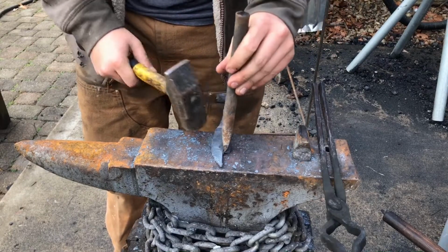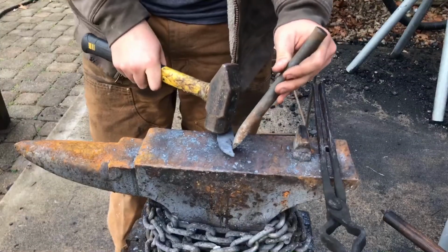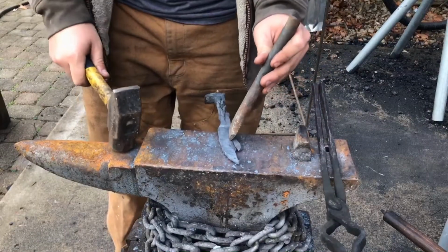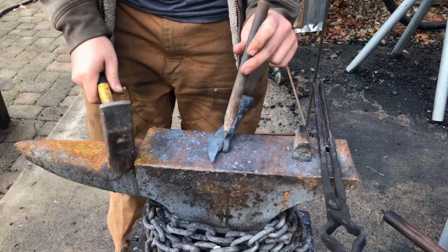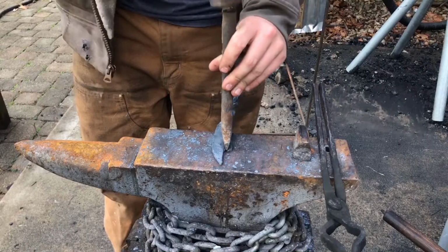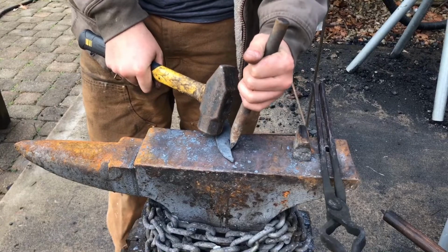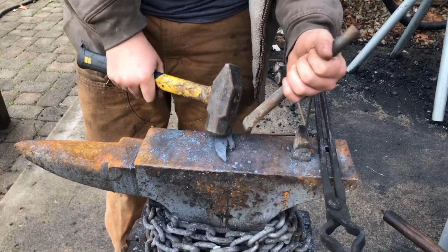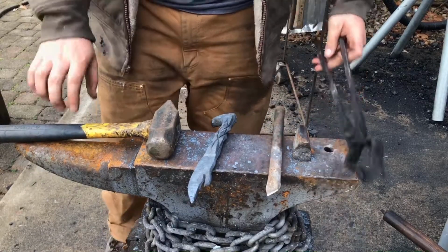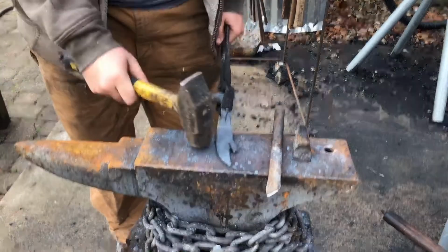On a lot of anvils, this is a common misconception. This plate here is not actually a chisel plate, which a lot of people used to think it was. What it actually was is a squaring up plate. It used to be an extremely precise, measured piece on all or most anvils that actually had it. The issue is people thought it was a chisel plate and used it to chisel stuff. And then over the years, they became warped and dented, so now they're pretty much useless as the true surface they were meant to be.